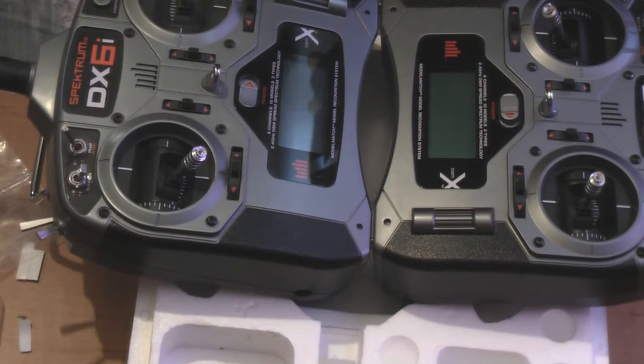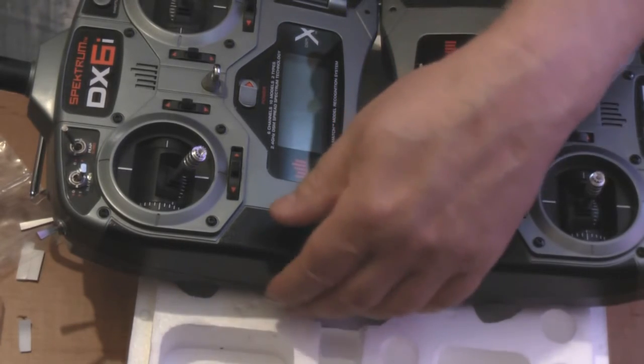Right, that's it then, guys. I hope that I've made your life in fitting the backlight a little bit easier, especially releasing those connectors, because they are really tight unless you get, like I said, that thin screwdriver and get it in there, and they come out so much easier. And don't forget that the power plug doesn't pull out, that is soldered in, so you need just to release what would normally be the charge port.